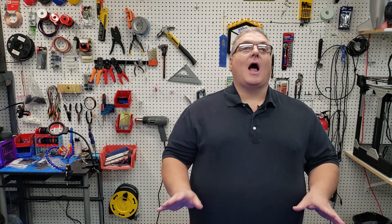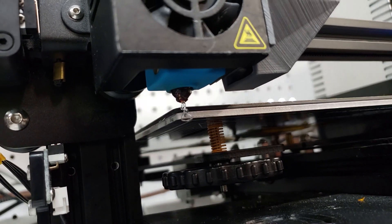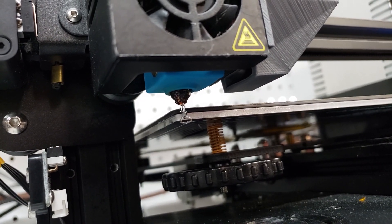The reason we'd want to do this is if you've built a new 3D printer — a good example would be the X301, there's a card at the top where you can check it out — or if you've upgraded your firmware on something like an Ender 3. Many times configurations aren't copied properly, or in a new printer setup you haven't ever set a home offset. If you've ever reset your Ender 3 and seen a situation where homing puts the head off the print bed, we're going to use M428 to set the real home location.